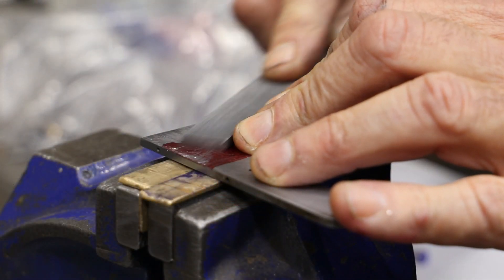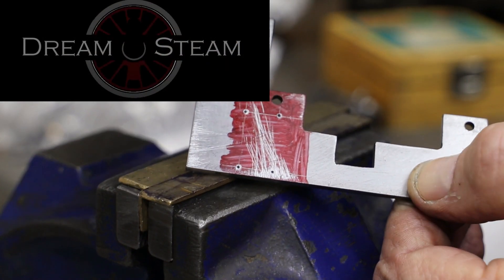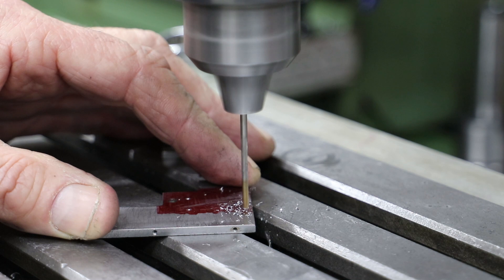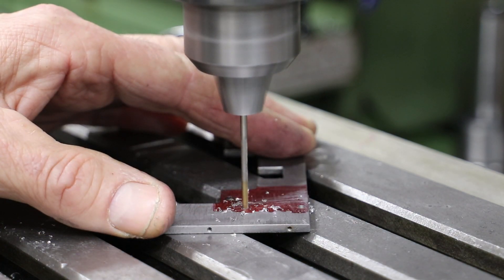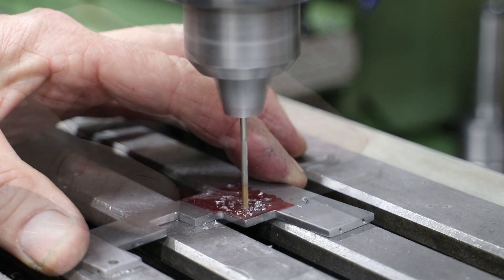Here's a great little tip that I picked up from Chris over on Dreamsteam: use a file to remove the high area around the centre punch mark. A word of warning — you'll often see me drilling small holes this way without using a clamp. This is really not good practice and I would suggest you don't follow my approach, even though I only do this for small drill sizes.